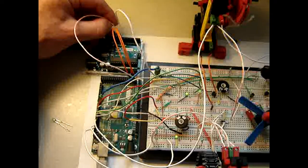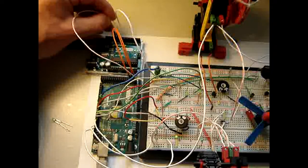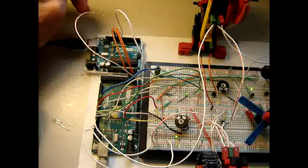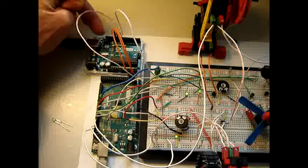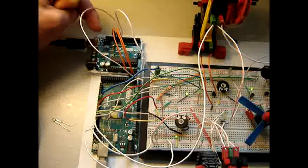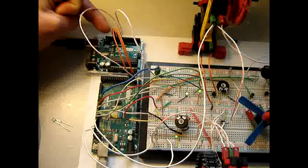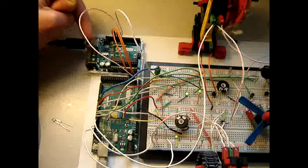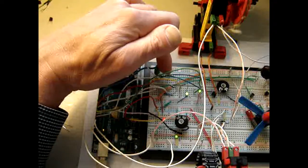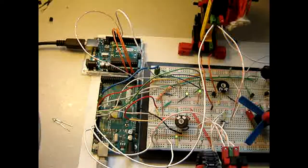It should stop whenever I lift this wire. Actually, it does not. So this means that I should take a failsafe that if a value is not being transferred, it should stop or show some different behavior. So, yeah, I'm going to change the code. And also think of how I can get this part of the circuit to work, because this is not right.